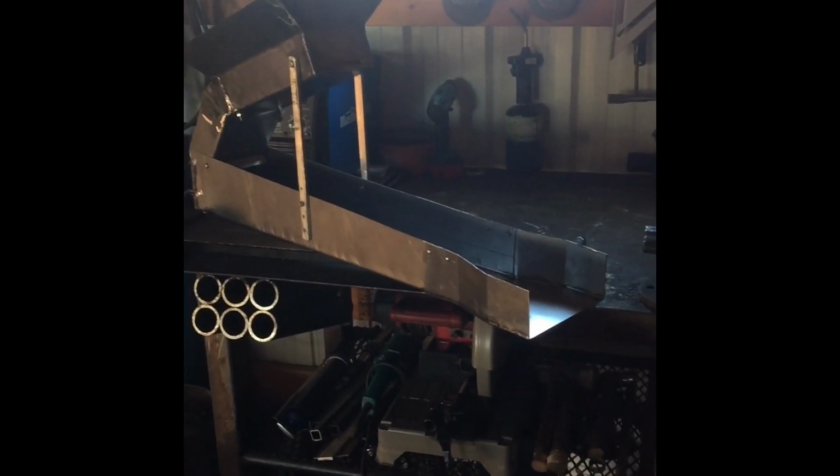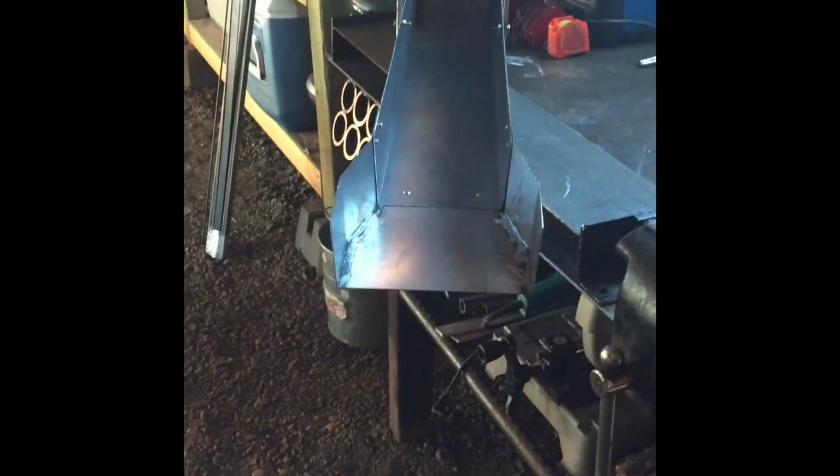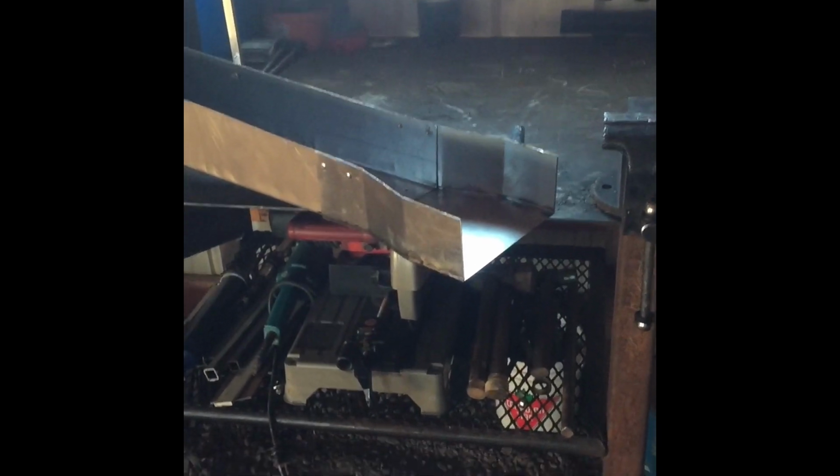Well, it's another day. Coming along pretty good. Got the flare put on. I'm totally winging it on how the sluice is going to react to that little submersible pump for water flow, but worst case I'll put some 1-inch spray bars and hook the 1.5-inch pump up to it and be able to run it just at a slow dead idle.